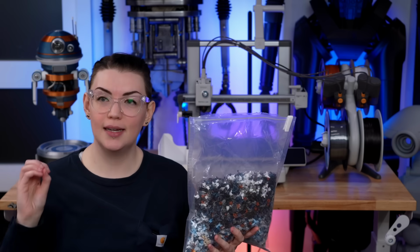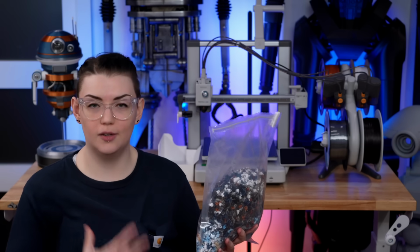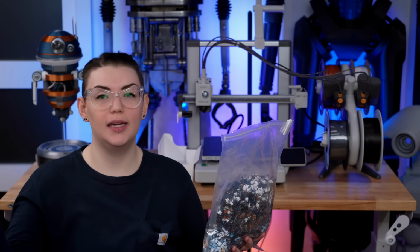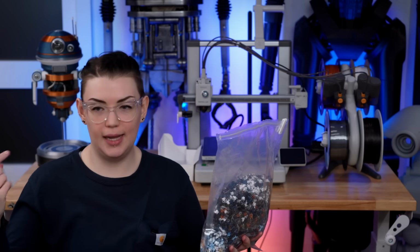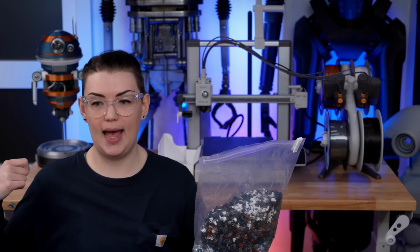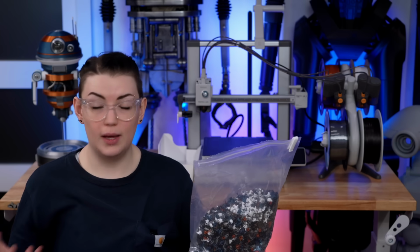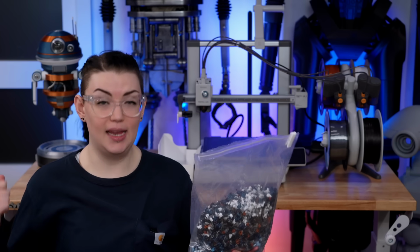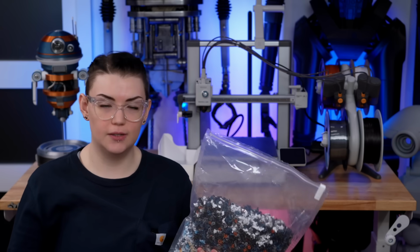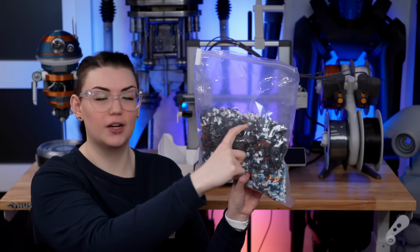There were certain color design choices that I made that I knew were going to produce a lot of purged filament. The second that you have a layer that has multiple colors, you're looking at multiple filament changes per layer times however tall that area is. So the bottom greebly bit on the booster of that droid had recessed lines that I decided to do black, so it kind of mimicked the weathering that I probably would have put on it had I painted it. Every single layer for that much of the print was changing the filament like 4 times, which is basically what all of this black and dark filament here is.